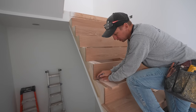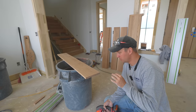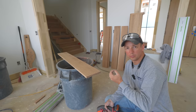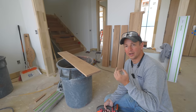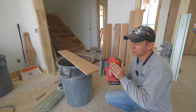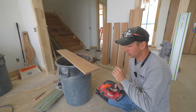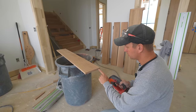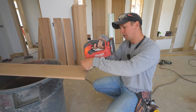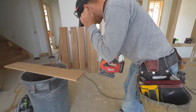It's very important we cut that notch out first. You want to be as precise as possible. You could use a handsaw — I actually started out using a handsaw and it worked really well, very precise, but it takes too long. I can get pretty good results just using a jigsaw with a sharp blade. You do not want it on the orbital setting — you want it straight up and down, that gives you the most control. I start at an angle and then rock it up so I can perfectly follow the pencil line.